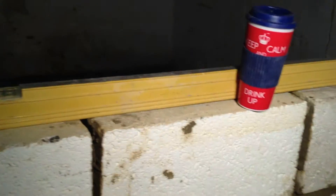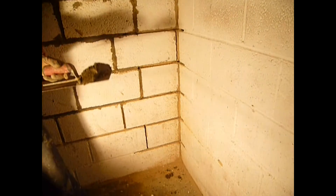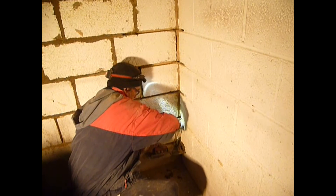What I've been doing is sort of one at a time, but this time I'm going to lay the whole course out roughly so I can adjust the gap nicely in between. I'm going to come back and do the heavy pointing in a little bit. I have to stop this one and start another one - I just can't upload more than a minute. I was going to use my margin trowel, but I realized this square trowel goes right where you want it and hardly any mortar will spill off, whereas the other one is triangle-shaped.